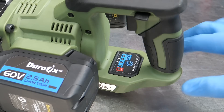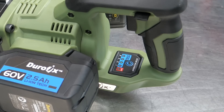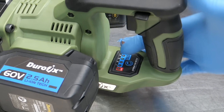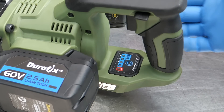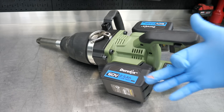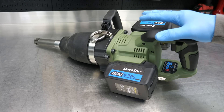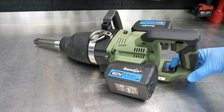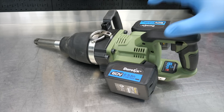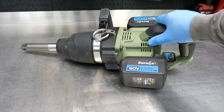We'll show the auto-shutoff on our test rig in a moment. Speed two shuts off at around 500 foot-pounds, speed three at 800 foot-pounds, and speed four or mode four shuts off at 1,250 foot-pounds — preventing you from over-tightening whatever you're working on. In max mode, the tool gives you the full 2,200 foot-pounds of tightening torque and does not shut off. In reverse mode, you get the full 3,000 foot-pounds of breakaway torque.